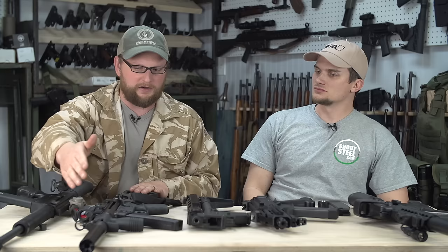Not simply. It could be done, but remember, guys, the MP5 was made to be manufactured, used, and disposed of. It's like an AK. The barrels and everything were meant to go a really long time, and the barrel life was meant to wear along with the roller replacements. By the time you've changed out rollers in your gun to the point where you can't get any bigger rollers in it, by that time your barrel's shot out.